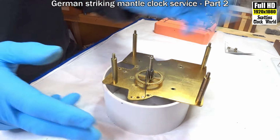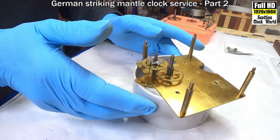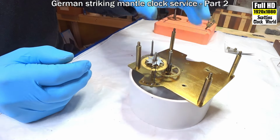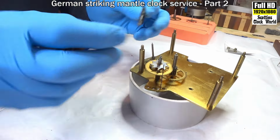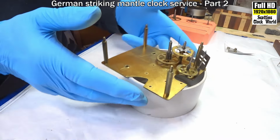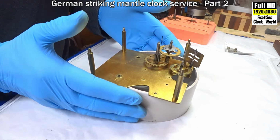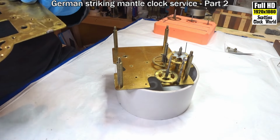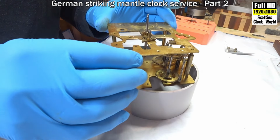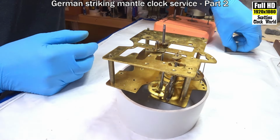The first wheel. Then star wheel. That wheel goes there. Then we'll put the fly in there. And that's a strike side setup. Now, put the top plate on once again. Got to go down into there. Nose and nose. Put a nut on down here to hold it.